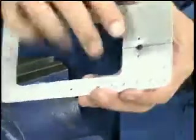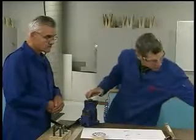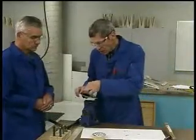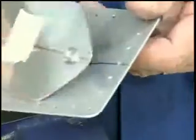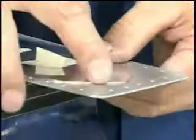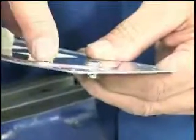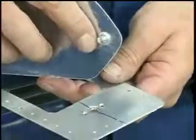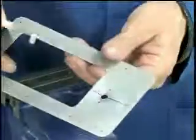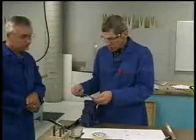and it dimples it down. If you want to check it, you can grab your access door and see that the access door now fits onto the doubler, and there's no gap underneath between the access door and the doubler itself. It fits nice. The little grommet raised area fits into that little dimpled area. The next step now is to install the spring.